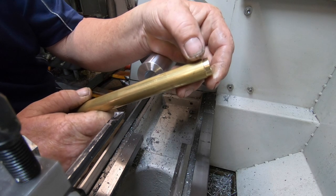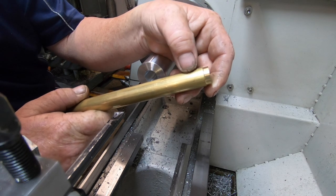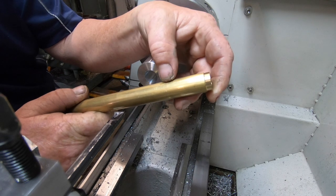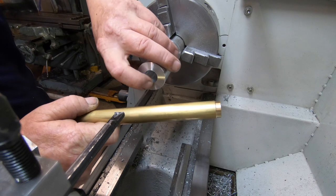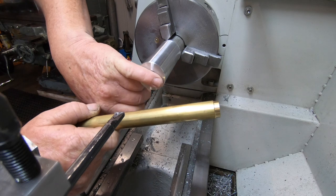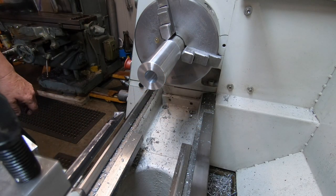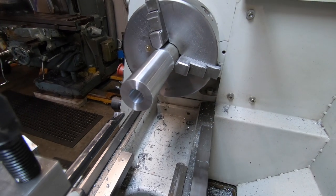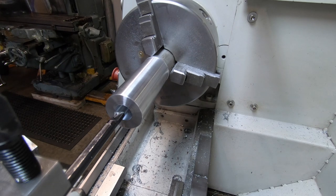That'll be just, I'd say, sort of sanded back to where it's going to be a beautiful fit for the piston. So this is coming out, this is going to go out to 740 thou. So I think I've got 23 thou on the dial to take off, 23.5 thou or something. But anyway, I know I'll swap between metric and imperial, but that's the way it is.